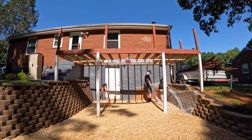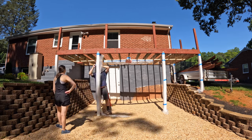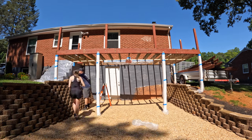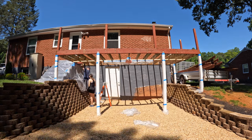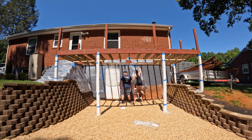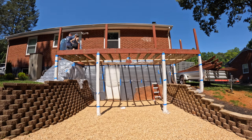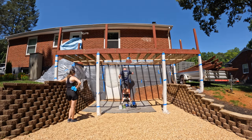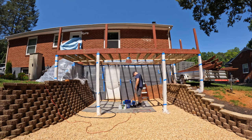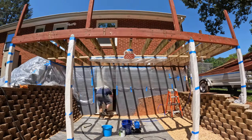The next step is to cover up everything with tarps and painter's tape because I'm going to paint the rest of that deck. Any of the wood I left, I chose to paint — a nice cowboy brown color using Valspar outdoor paint. The reason I did this is to protect that wood and keep it from rotting anymore. There were a couple of pieces I had to fix, but overall the wood was in pretty good shape. The easiest way to paint this deck is using an airless sprayer — I have a Graco Magnum airless sprayer, just a residential version, and it worked really well. I'll throw a link in the description.